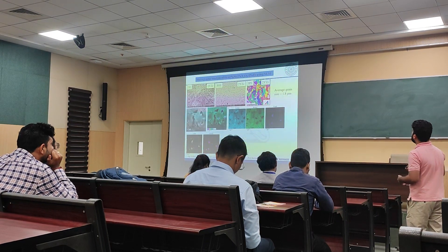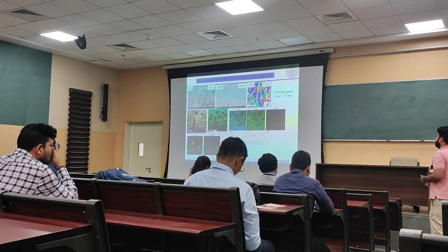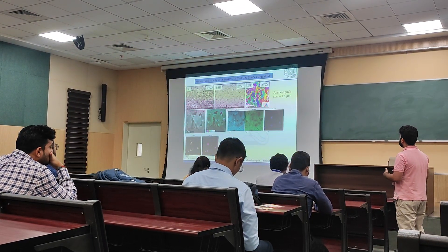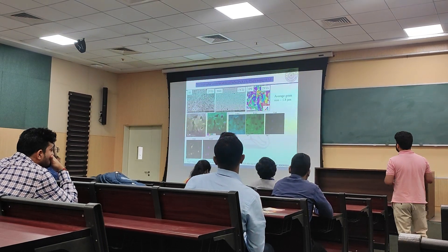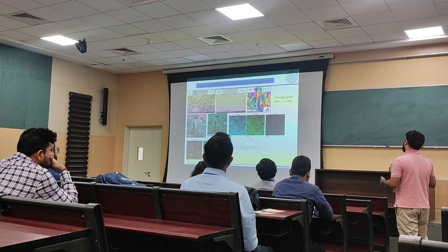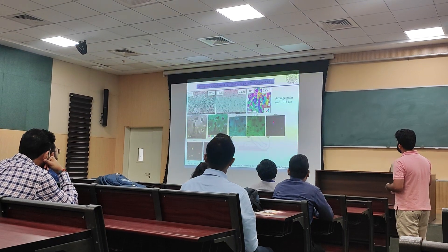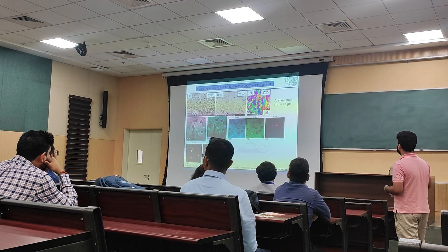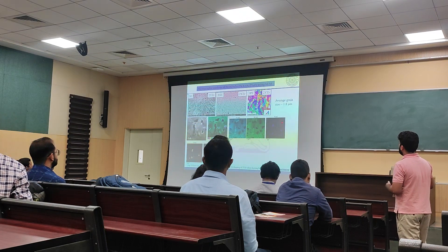In the case of the iron-nickel-zirconium alloy after introducing yttrium oxide, we found that the average grain size was reduced. The reason is that yttrium oxide addition led to the formation of several dispersoids, as seen in the earlier XRD, which restricted grain growth of the metal matrix — due to this, grain size was restricted and mechanical properties increased. We can also relate this to the curve discussed earlier: the positions taken by yttrium and zirconium are the same because all three elements have high affinity, making dispersoids that are yttrium, zirconium, and oxygen composites.